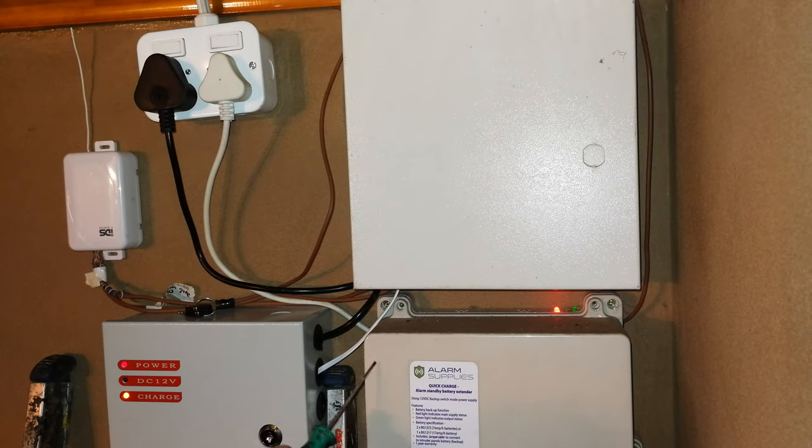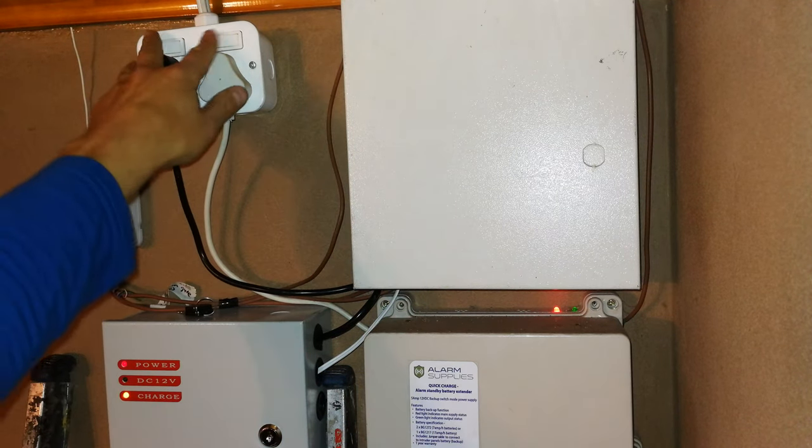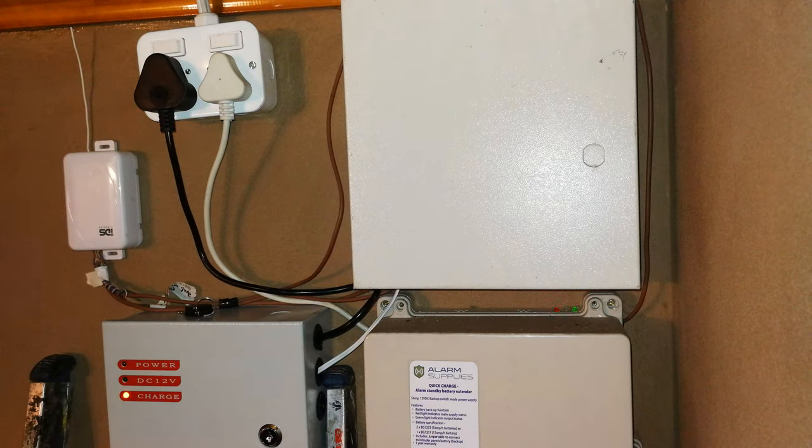So there you can see: 0.5 on one backup power supply and 0.4 on the other, giving me 0.9. There is the finished product — the first power supply and now I've added another one. This one is sitting at 0.5 amps, this one at 0.4, keeping in mind that the siren and smoke detectors are on this one. So when the alarm activates, this one is going to be loaded more — continuous current is 0.5, but peak current will go up to about 0.9 when the siren activates. So even if I switch it all off, nothing will happen to the alarm.